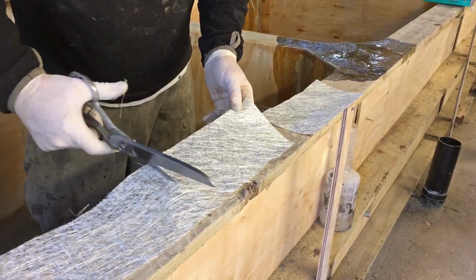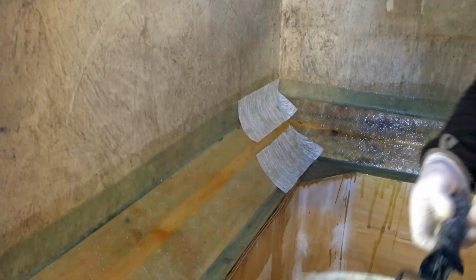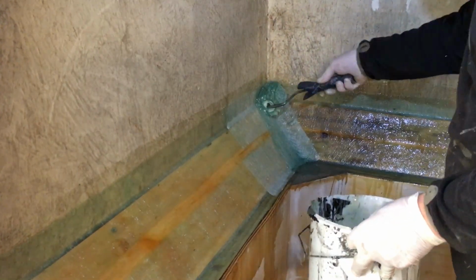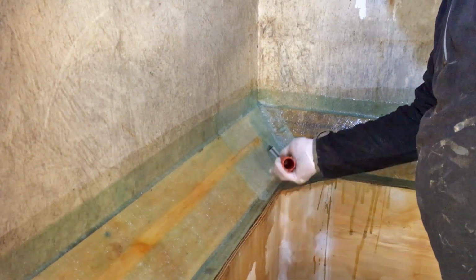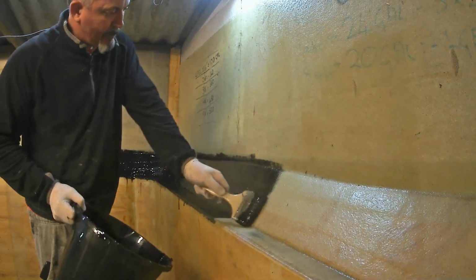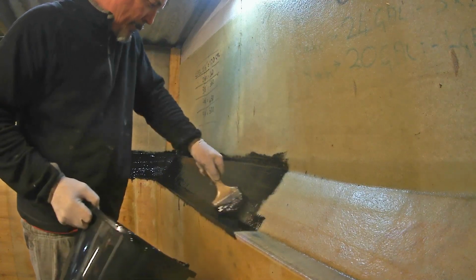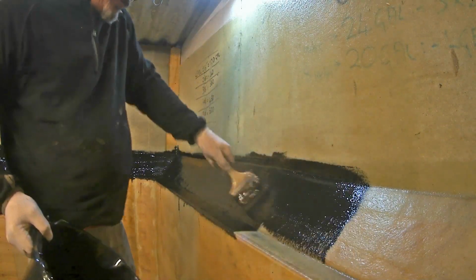The resin can set quite quickly depending on the conditions and the amount of catalyst added, so preparation and experience are required in doing a good job. A final layer of resin is applied over the top to form the watertight coating. This can have a pigment incorporated and will contain a wax that is needed to fully cure the resin. This is referred to as the flow coat.